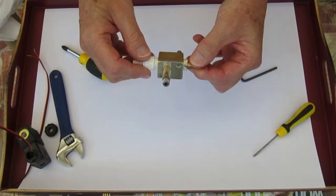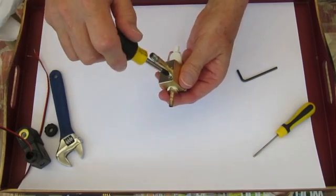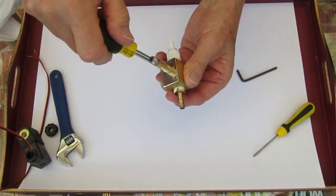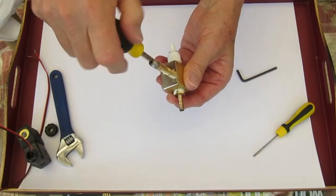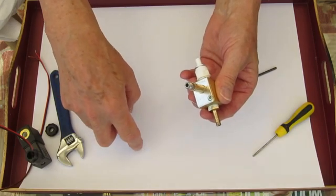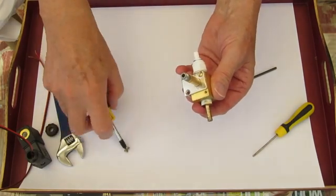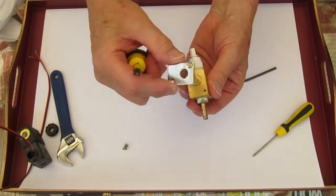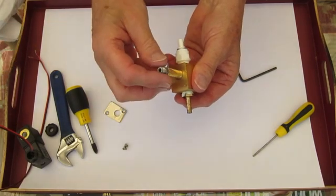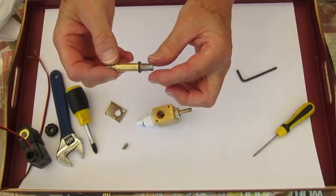Which is the piston. Now we're going to remove this plate by removing these two screws. They're small, so you need to look after them — my screwdriver's slightly magnetized. Here we are, and you slide off the plate. Now you remove the sleeve that holds the piston by giving it a bit of a waggle and a pull, and there you can see the piston and the sleeve.